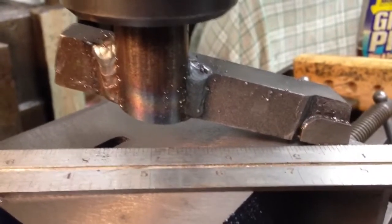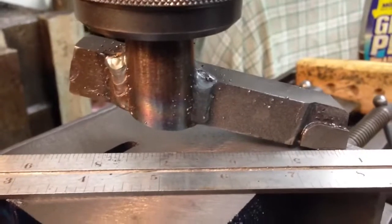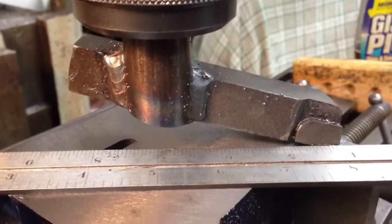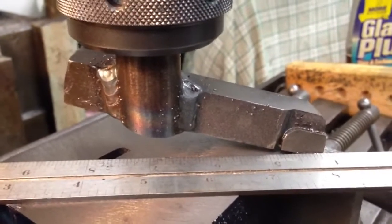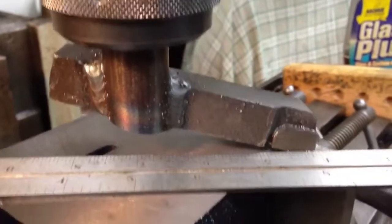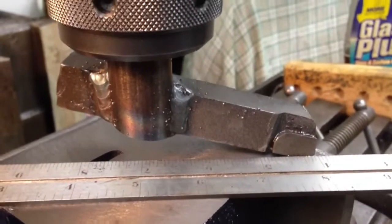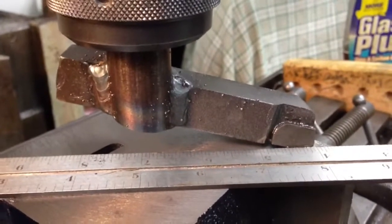The thing works great. I was pulling about 50 thousandths. In the one video it was inch-and-eighth feed and 400 RPM, and it really did a nice job. I've used this for a few things. Of course it was cast iron, but I've even used it on steel — it works pretty well. With a little lubricant, on aluminum I didn't have any trouble either.